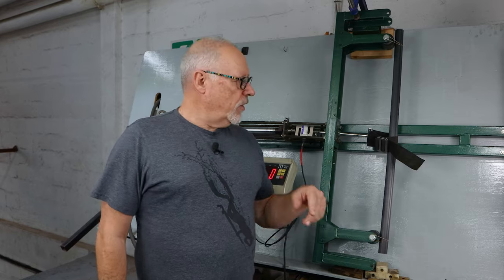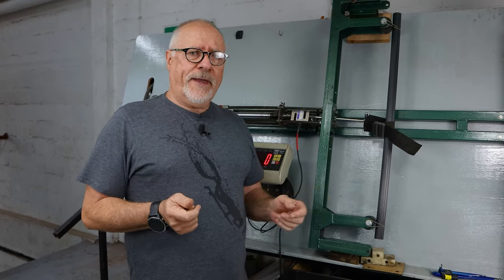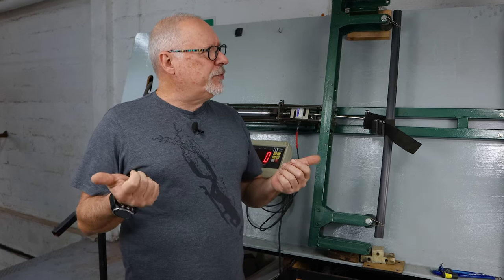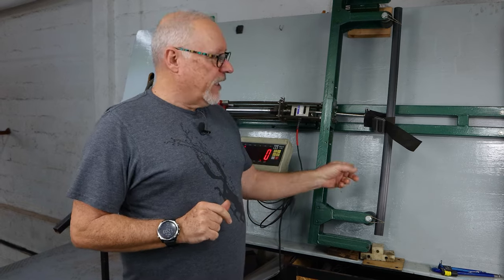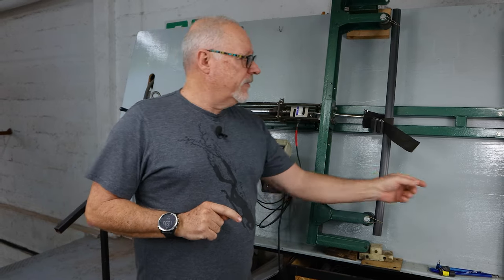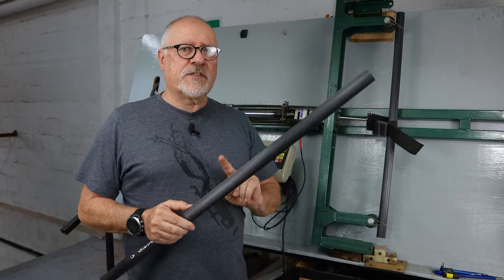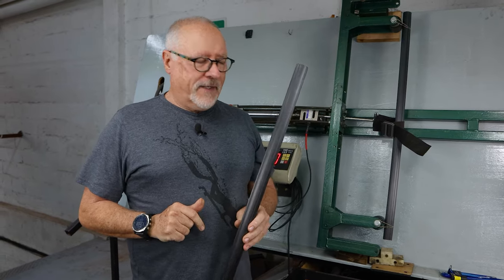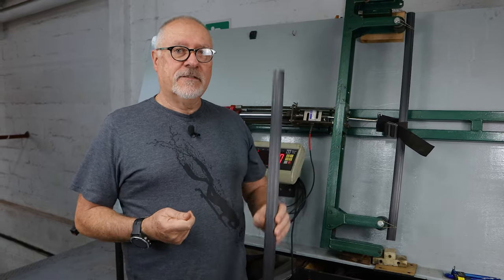Hi guys, welcome to another testing video. Today we're going to test carbon barrels again. We did this test about a year ago — we did an aluminium barrel test that failed at around 125 kilos, then we took our rail carbon barrel up to 295 and it was way overkill. We're happy that it didn't break; we don't want pieces of shrapnel flying around. Today we're doing the same test again with the carbon, because we've had to change the fiber to another manufacturer. Long story, but we need to make sure it's the same as what we used to use or better — anything over 250 is double that of aluminium.